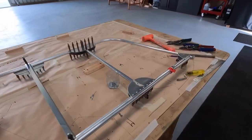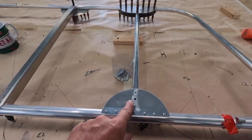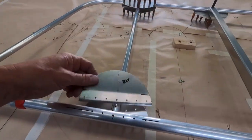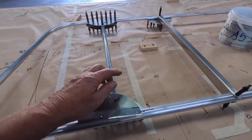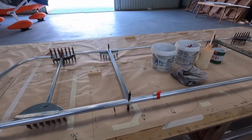So now just going through, deburring. You can see this one's a finished product with my bolt hole. That'll be for the bracing wires. And the deburr process, clean them all up, final rivet. Paying attention to, I've got to get the swarf out as best I can, get the swarf out of the tubes. That's where we're at the moment.